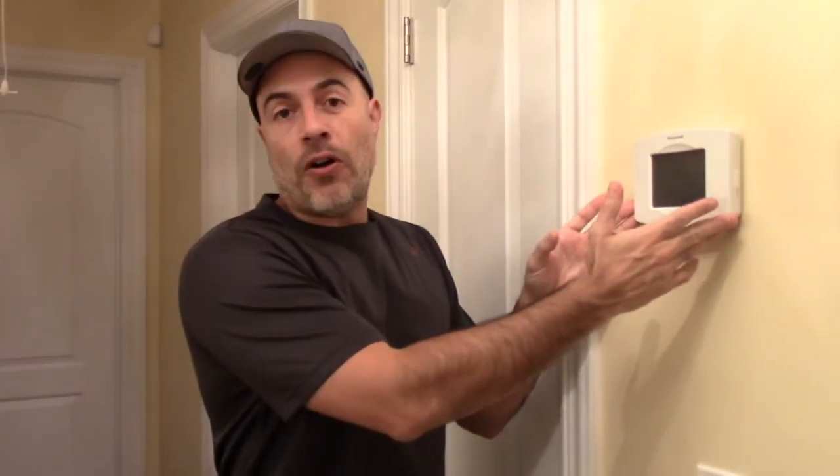I'm going to show you how to change a Honeywell thermostat. This one has been working great — it's Wi-Fi enabled and no problems with that — but the problem is it's in the middle of my hallway and the heat from the first floor comes up through the stairs, heating up the thermostat. It cuts off thinking the second floor is warm, but the rooms are all cold.